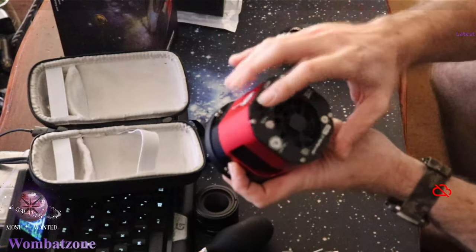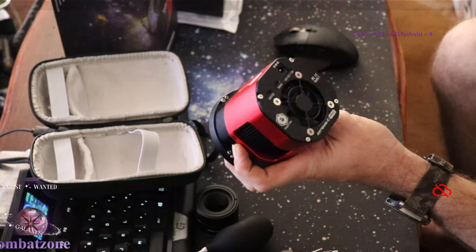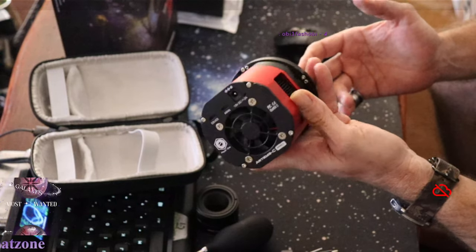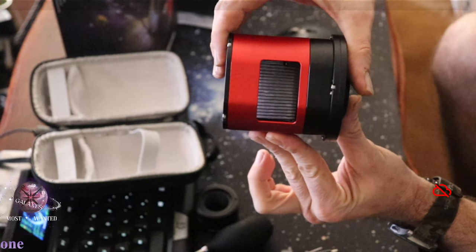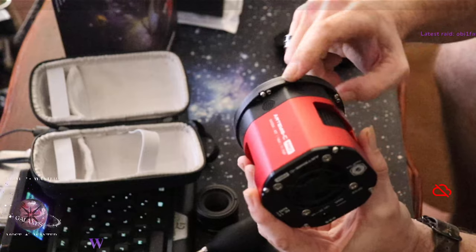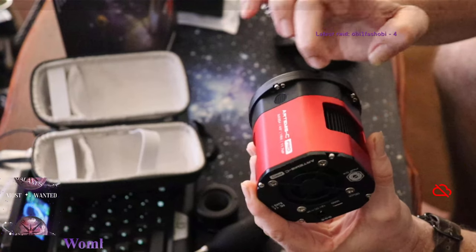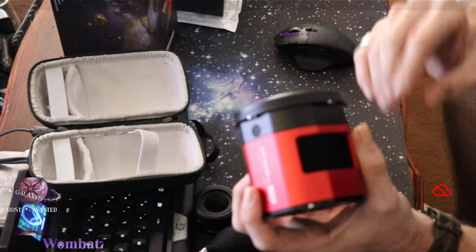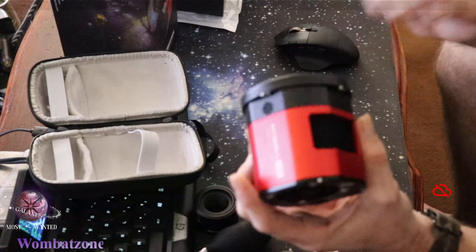As soon as you connect power, it allows you to activate the Peltier plate, the dew heater, and the fan. We've got a main USB-C and also a device USB-C - the device one is for filter wheels and any other accessories as a pass-through. It's got a pretty beefy heatsink and a hefty weight to it. Built into the camera you've got two sets of screws - one's a locking screw and one's the actual adjustment screw - with compressed foam around it so the tilt mechanism works without any light bleed through.